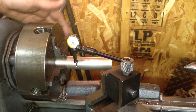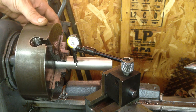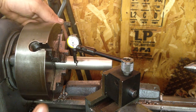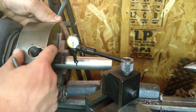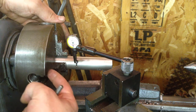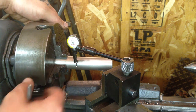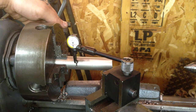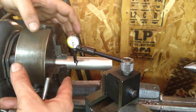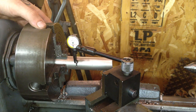I'll be covering how to take a piece of round stock and put it in a four-jaw chuck. A four-jaw chuck is nice if you have a regular piece of stock such as a square or something odd — you can tighten each jaw individually, which lets one jaw be way over here while another is way back to grip that odd piece. For round stock, a three-jaw is nice because it self-centers: you crank the chuck and all three jaws move toward the center. But I don't have one, so I'm going to make do.